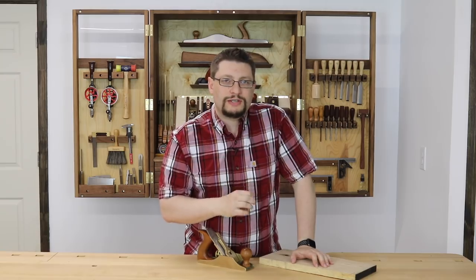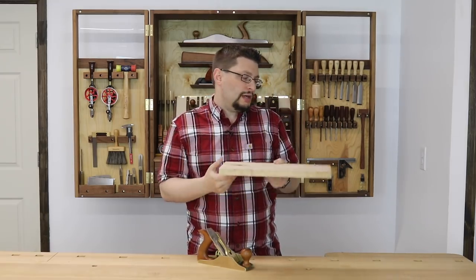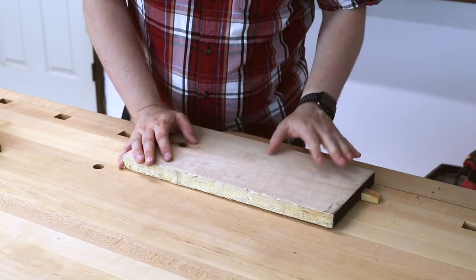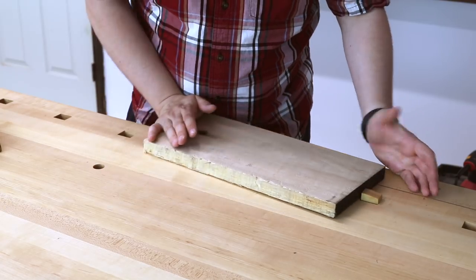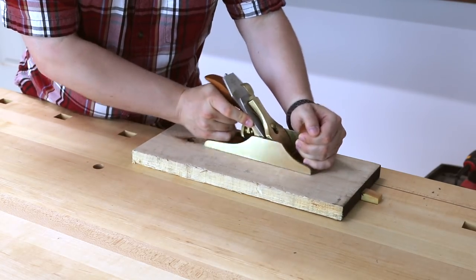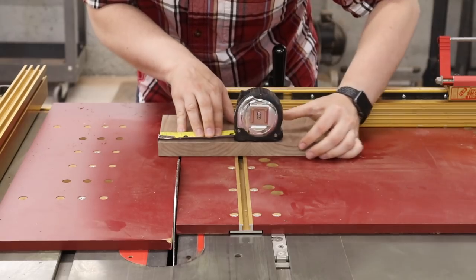The first jig we're going to build for the bench is a T-stop. Let's say you've got a piece of wood that's wide like this — this is six plus inches — and you want to do some hand work on it. If you take this piece, grab one of your bench dogs, put it into your dog hole, bring your board up, it's just got one point to stop it. That becomes a pivot point. Instead of coming in with your hand plane and being able to do work, you're going to end up pivoting as you apply different forces against this piece. So what this T-stop is going to do is prevent that pivoting.